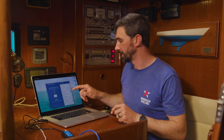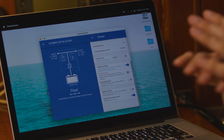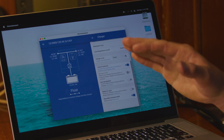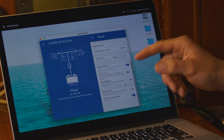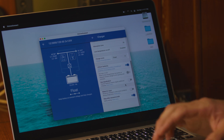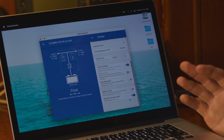A very important selection is the lithium batteries tab — make sure that is on. It's going to stop any voltage change based upon temperature, which you do not want for lithium batteries, so we see the charge curve is fixed as a result. The next two options are disabled because we have the lithium battery selection on. If you have problems with your AC input, you can adjust the weak AC input selection. The final safety setting — stop after excessive bulk charging — if you keep throwing lots of power at the batteries and it's not finishing the charge, this will recognize that and stop charging.